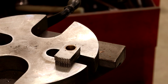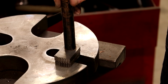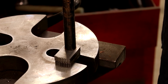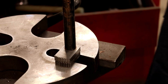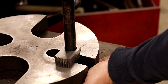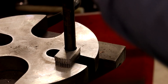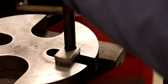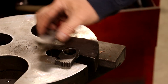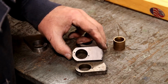We're back over at the arbor press and I've got a little piece of metal here that should be large enough to catch the inside but small enough to not catch the outside of it. Let's see if we can just push that right out. There it goes, and there we go. We got our new segment gear all made.